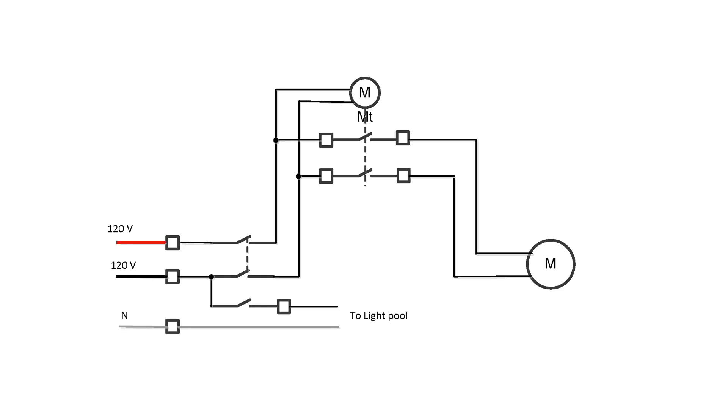The general diagram of the pool motor electrical control panel shows that the electronic timer, when power is applied, must work constantly. The timer motor rotates the dial continuously, but now we don't hear the sound of the constant rotation of this motor. The probability that the timer motor and pump motor have broken down at the same time is almost zero. Therefore, it must be assumed that there is no voltage being supplied.